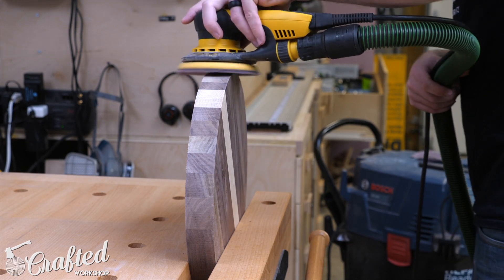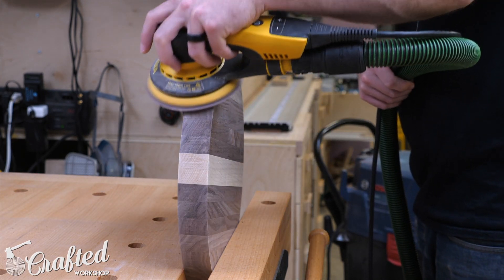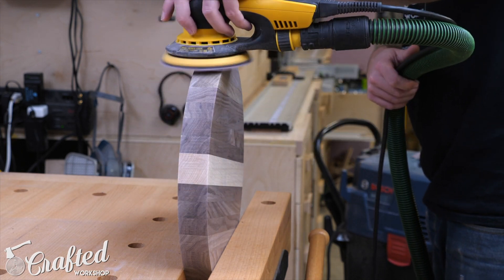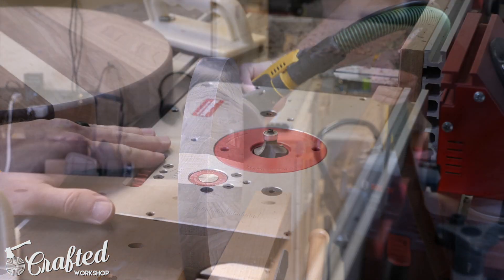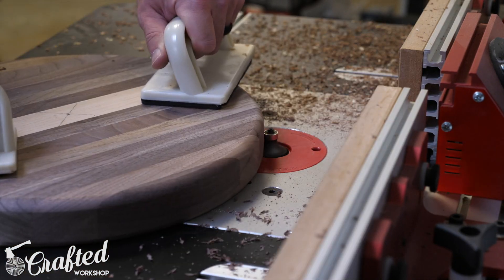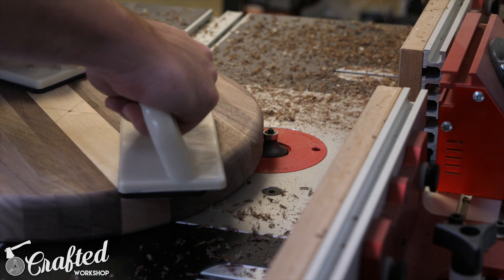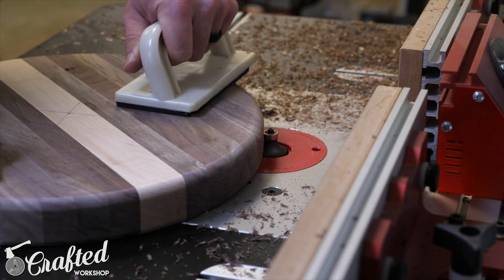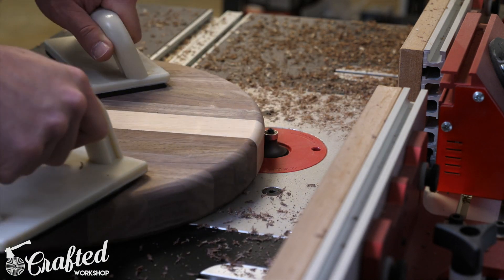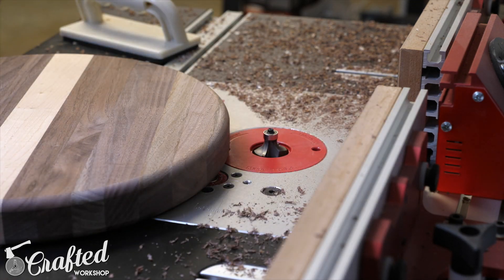The final diameter of my seat was 13 inches, so I needed to add another hole between the six and seven-inch holes, cutting to rough size on the first pass and then to final size on the second. After cutting to final size I sanded the edges smooth — there were a few blade marks from the bandsaw, so I started with 80 grit and moved up to 120 grit. To give the seat a more comfortable feel I added a 3/8-inch radius round-over to the top and bottom edges at the router table, doing it in two passes to avoid tear-out from the end grain.